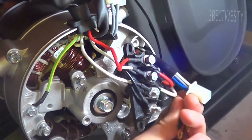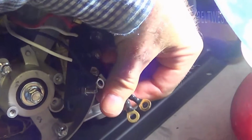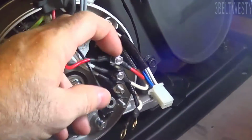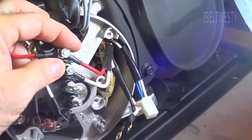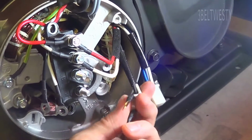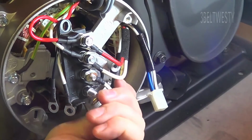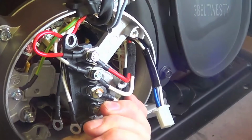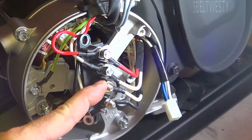Again, this is the 120 volt. Each one of these pairs off the stator here, that's a white and a black. That's one pair. The white and the red is another pair. Those are in phase. Somebody else had mentioned they're not in phase. They're in phase. They have to be in phase because they add normally to be 120 or 240 volts. So in a normal configuration, the two whites are connected up front in the connector together.